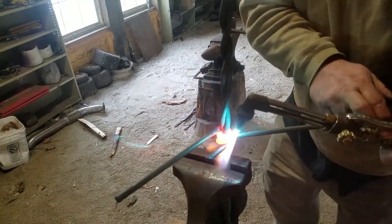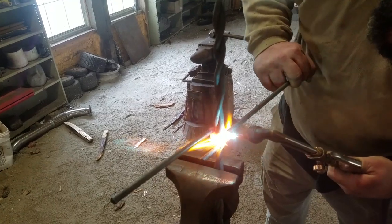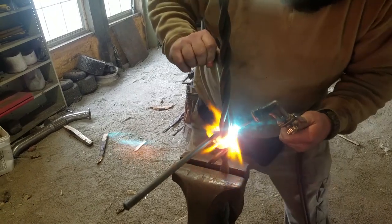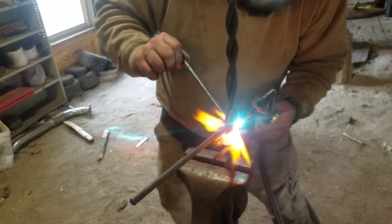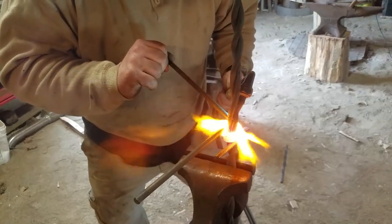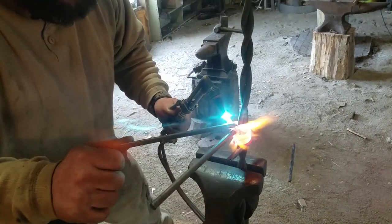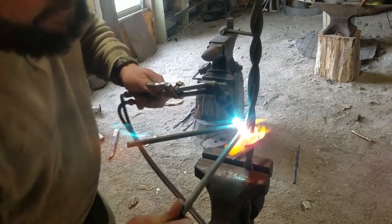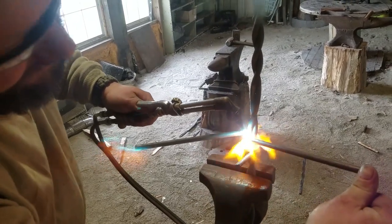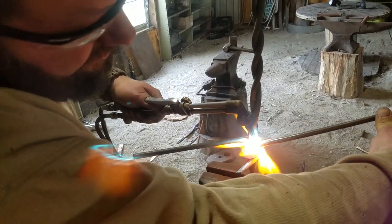I always like these a little long so I've got a place to grab onto them at the tip where it's cool. Material's cheap — it's not worth getting burned or slipping off with your tongs and running your fist into this hot beast. Why don't you wear gloves? Because I slip and burn myself through gloves way more often than if I've actually got my hand on the piece. You notice a lot of smiths work barehanded. You've got to feel what you're doing, especially when it comes to getting all the little sharp edges off things for your customers — you'd want it to cut you, not your customer. So you've got to run your bare hands over everything and make sure you get it smooth.